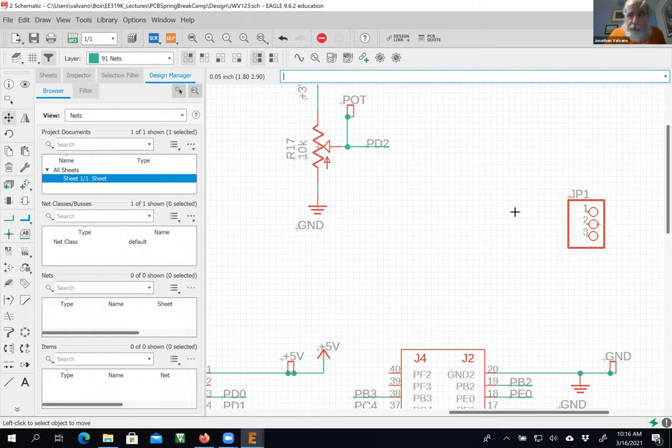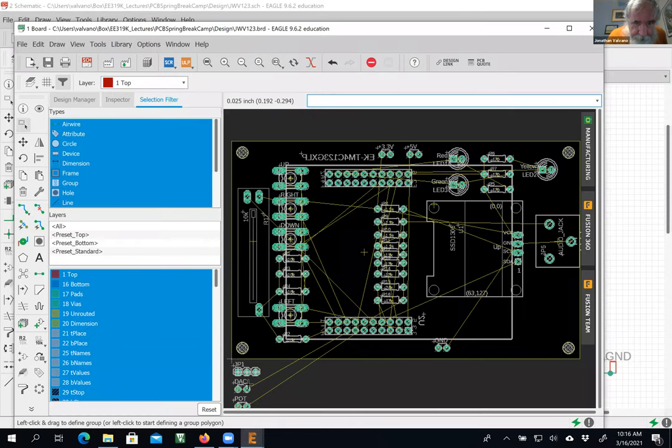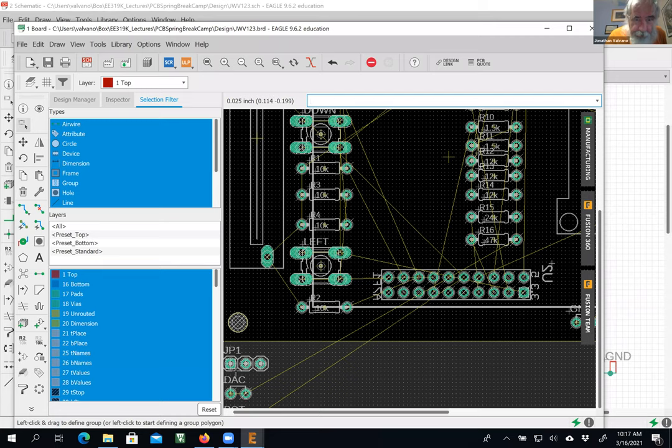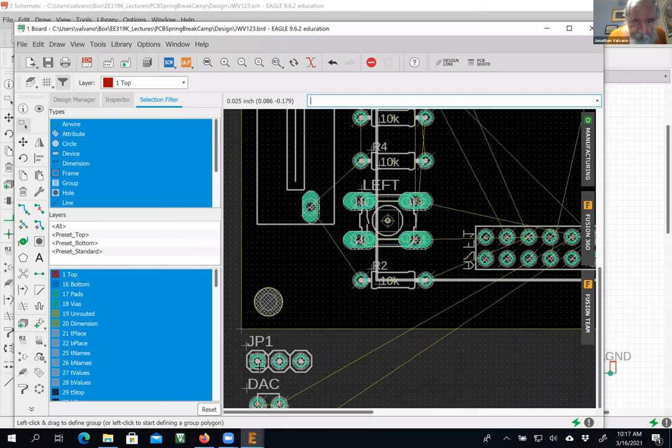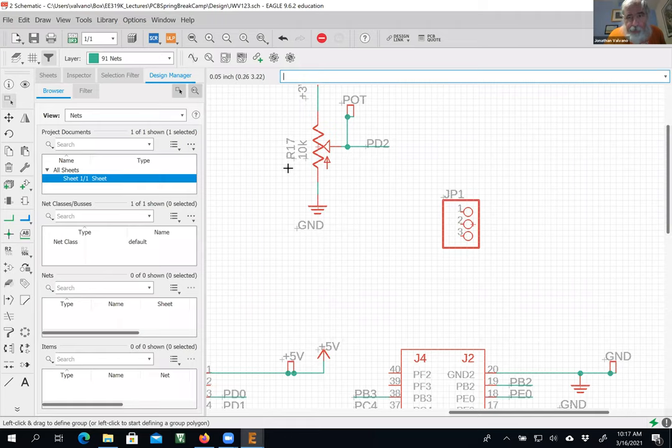So this is going to be my lab 9 connector. So if you had two boards and you wanted to communicate through them, we would wire up these. And so if I look over in the schematic view for that, I can see that one of the pins is square. You see that? See that one of the pins is square, okay? And that pin, the square pin, is the one I want to be ground. All right, so I'm gonna connect a pin here and ground it.